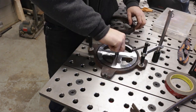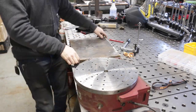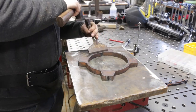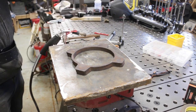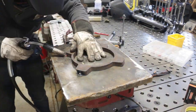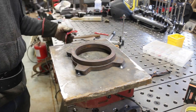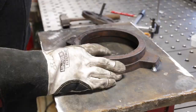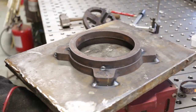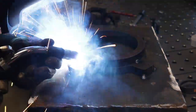I just do a little temporary clamp-down and sort of get an idea of what this whole thing is going to look like. That red thing on the table is a rotary grinder — it's actually made for a rotary table so you can grind round parts or grind a perfect chamfer on the edge of a round part using a surface grinder. I picked it up at an auction and thought it'd be a good tool to use as a welding rotary to weld this perimeter and join these two parts of the base together.